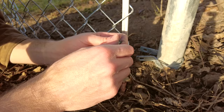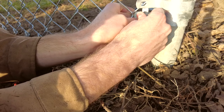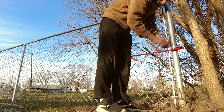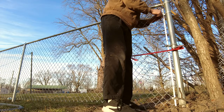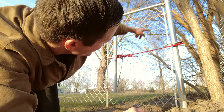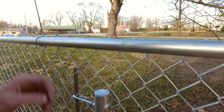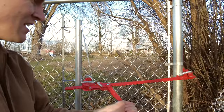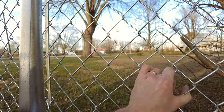Time to put these tension bands back on and hopefully this is tight enough. I should have paid attention — the mesh is a little too close to the ground and not quite up to the bar, so I've got to loosen it and drag everything up. I repositioned things up a little higher so the very top of the chain link is right where I want it, just above the bar. Now I'll loosen up this clamp by shaking it. Oh yeah — that's what I like, just a little bit of give but not that much.